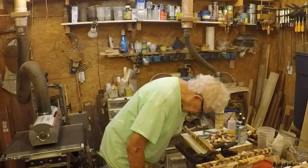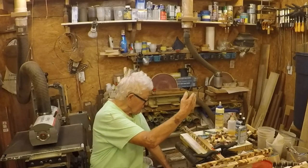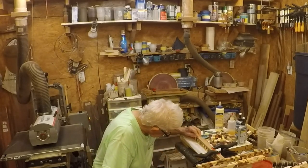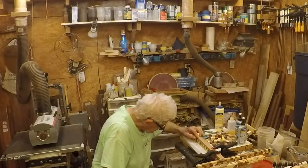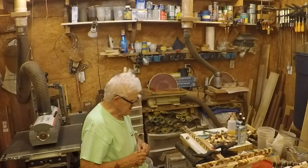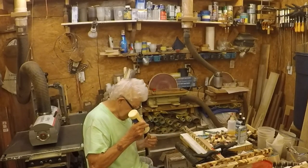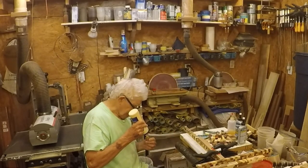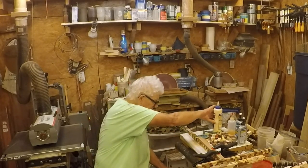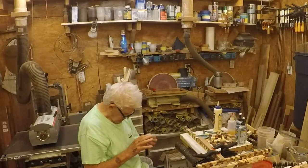Third row on. Again, I'm reversing the angle. I'm going this way with the angle this time. Try and get this one lined up so the row will glue on straight. Got to get enough glue on it. Glue it good to the row below it. Then I got to clean the squeeze out up. I'm going to let it sit just a little bit before I start gluing the rest of the segments on, so it don't move when I push against it.